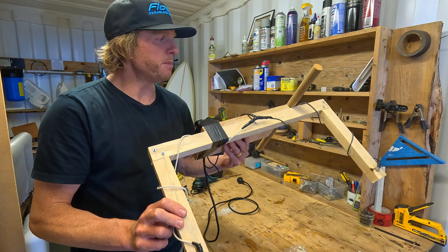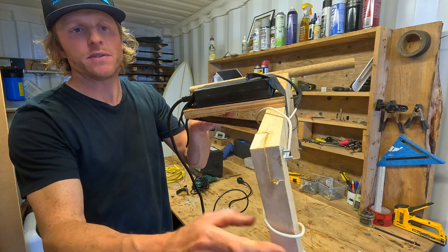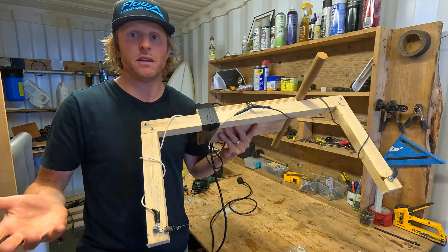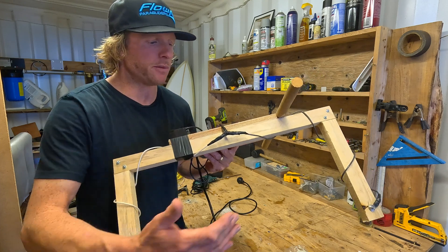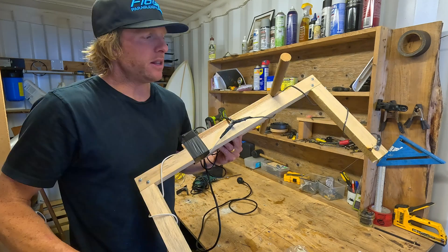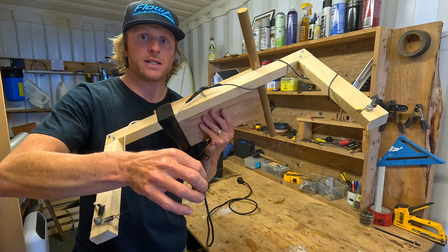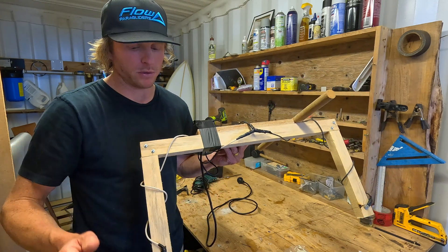The construction of the bow can be any shape. I've just used a couple of pieces of timber with a simple join and a few bolts. I built this specifically for my needs because a lot of the foam I'm cutting is around 12 inches or 300 millimeters wide, so it's the perfect width with a little wiggle room either side. You could build this to any size, keeping in mind that the bigger you go the more power you need to keep the wire hot, particularly where it's dissipating heat as it pulls through the foam.